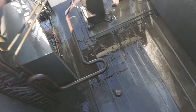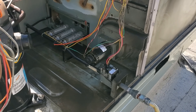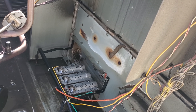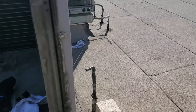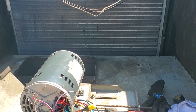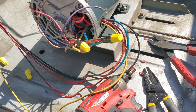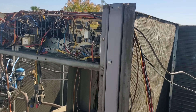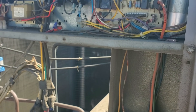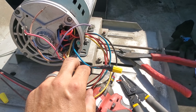Went ahead and rinsed out all this area right here and the combustion area over here. Went ahead and rinsed that out too. Not that they're using the heater right now anyways. Blower assembly's all dried out. Units all dried out. The customer did complain — apparently we got some water dripping down into the ducts, but it's since stopped. I'm just trying to wire the new motor right now and then I'll set it up like we had before. We need to vacuum out in here too. We'll get to that, but I'll set the motor and blower assembly in, so we're just wiring it all right now.